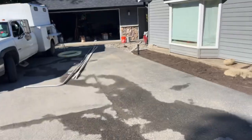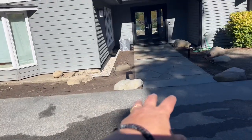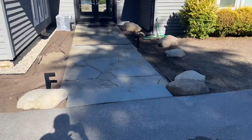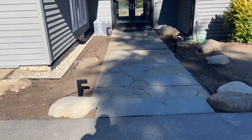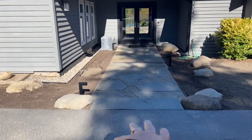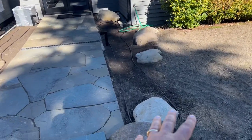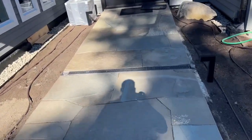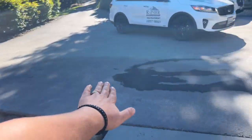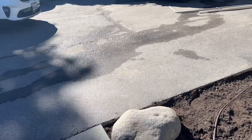With that area raised up 2 inches, I might need to have Wepler come out and meet with me to see if that's going to be possible — to create that indentation and still get water to go this way. In this area, if we make a little indentation, can we have some of the water that lands here disperse out into the landscaping? We don't want it going all in one area. They also have a drain right here, so we could bring that up 2 inches, depress this a little bit, and gradually float it out that way to make sure water in this spot flows out.